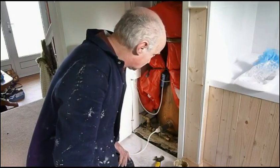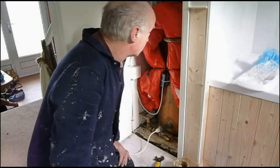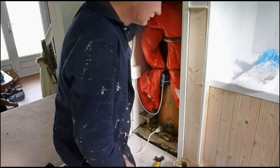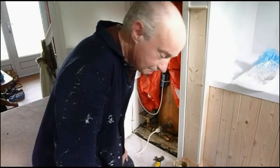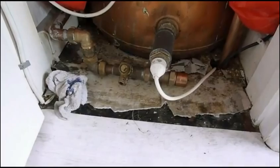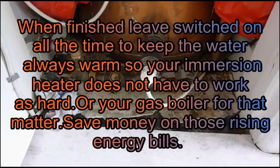That's the hardest part really — getting this element in is probably the most difficult. As I say, if it proves too difficult, get a plumber to do that bit — it'll still be worth doing. And don't forget, if it won't go in the bottom, you can always put it in the expansion at the top. That's it for the plumbing part. There is the finished article as it should look if you can get it into your cold feed at the bottom of your storage tank.